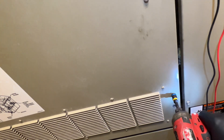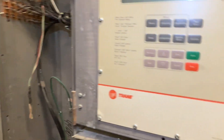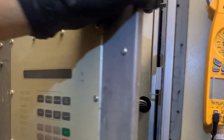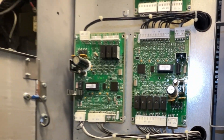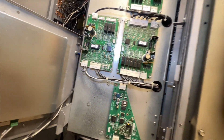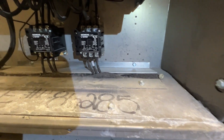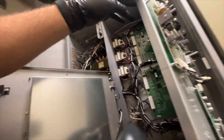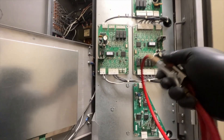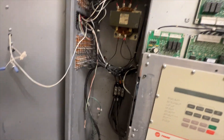Now we need to check our electricals. You're going to need a three-eighths drill bit — usually there's one here and one here, but these are missing. This is how you get to your electrical stuff — all your circuit boards are here. This panel just opens up like that, and I'm going to do a visual inspection and then use some CO2 to blow out all the dust. You have full access to all your boards and transformers. There are fuses here, breakers for each compressor circuit, and the contactors for the compressors. It's important to keep these boards clean — dust particles can really cause a lot of problems, especially with circuit boards.